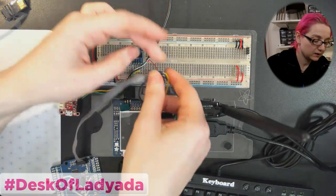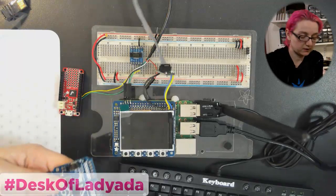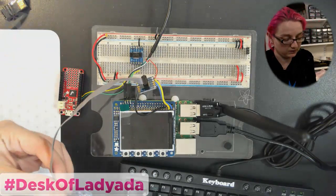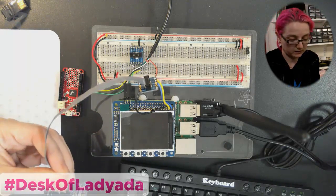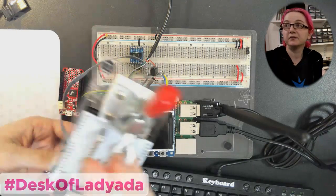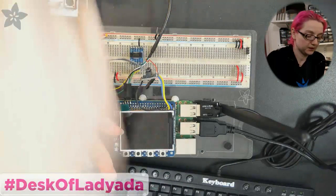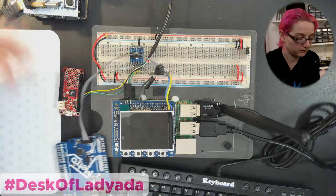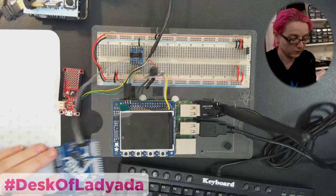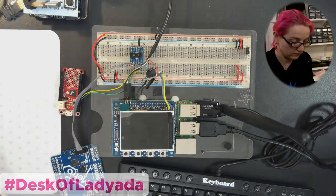And so the cycle will be, for every time you have to test a new device, you'll have to plug in this cable, which is not too bad. Plug in the micro USB, and then there'll be a bed of nails tester like this, where it'll clamp down and test the GPIO. But we're gonna skip that for now, because I want to get the programming good. The self GPIO test is super easy. I do that all the time.